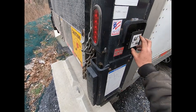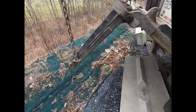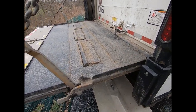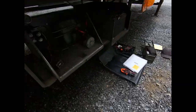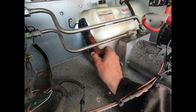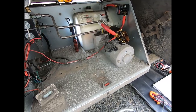We're going to lift it up out of that travel latch. Also noting that the travel latch keeper - the little piece of metal that comes up and down - is missing, and this travel latch ear is bent down pretty bad, which makes stowing these things a lot harder. Pressing up on the toggle switch to raise it, then unfolding - liftgate is all the way up at deck height and unfolded. According to the manual we should be three inches away from the top of the reservoir.